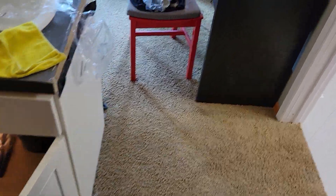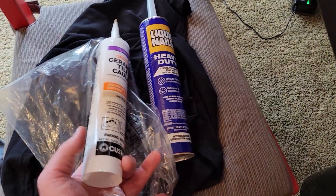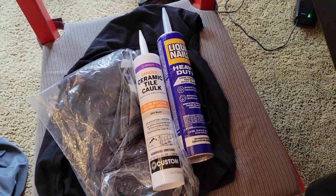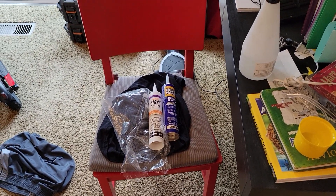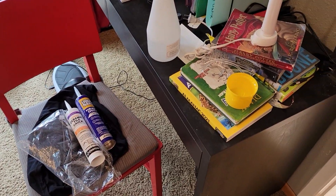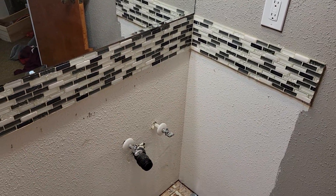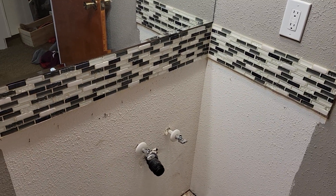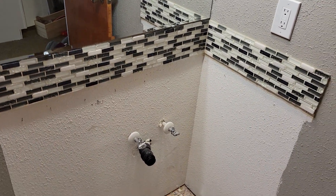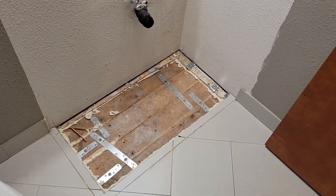I have glue to glue the tile in here, and I have caulking — grout caulk — which is not the same color. I'm aware of that, so that sucks. I would say around here where it connects with the countertop, use clear caulking. Don't use that grout caulk on there. The grout caulk is for actually where the tiles join each other.